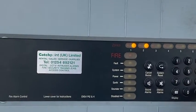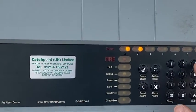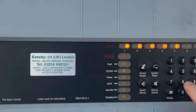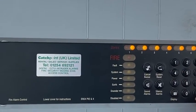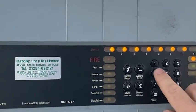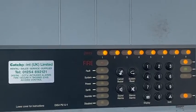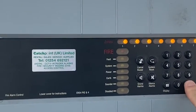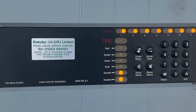Repeat the process for all the zones you want to test. This will allow you to test with sounders active. If you want to disable sounders, press shift, 1, 0 — sounders are disabled.